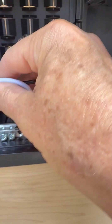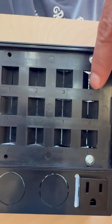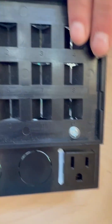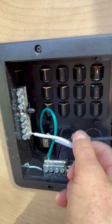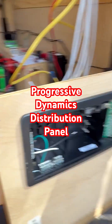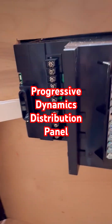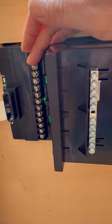And this wire that comes with the box is actually just for a plug that's available on the back of the box. But otherwise, you feed all of your wires into these holes, and then they come through here. You connect the neutral and the ground, and then you take your hot wire and plug it into your circuit. The other thing on the back here is this is the neutral for the 12-volt, and here's the hot for the 12-volt.